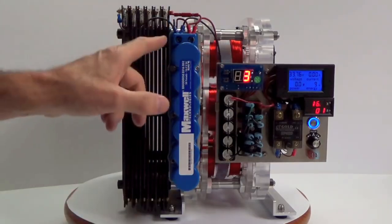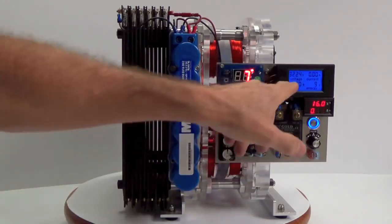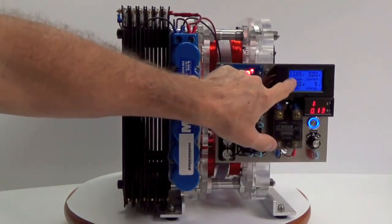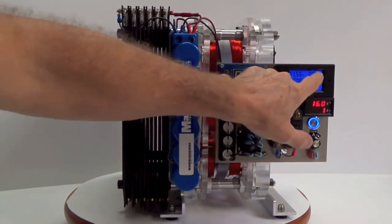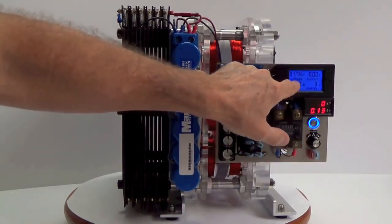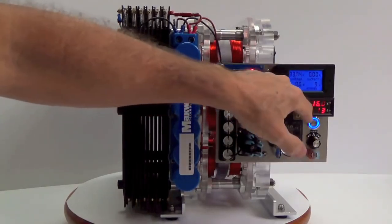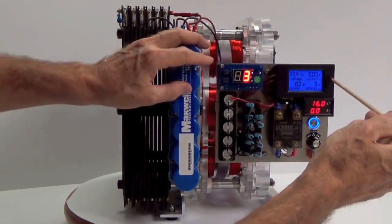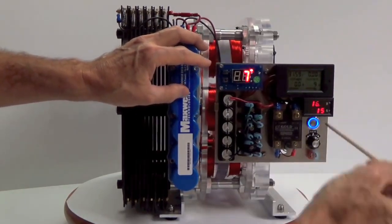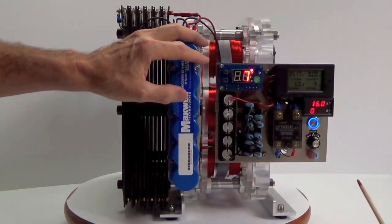Now, also, this machine will produce nearly 100 volts. This 32 or 33 volts that you see right here on the meter right now, and of course there's no current showing and no power output in watts. It also stores the watt hours too. I've been testing this, and I got 9 watt hours. You can press this button right here, and if you hold it long enough, you can access a menu that clears this back to 0 if you want to do that.